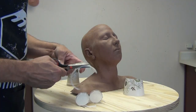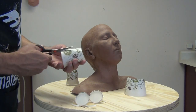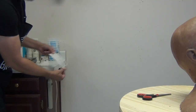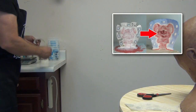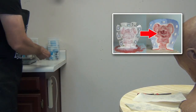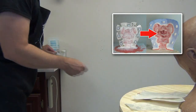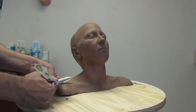In order to isolate the head in the part of the mold I want to make, I'm going to cut up some paper cups and create a little shim dividing wall to isolate the head from the shoulder area. I'm doing this instead of brass stock or metal shims because it's much easier to clean up. I've cut out wax paper cups and I'm using the countertop to straighten them out. For those unfamiliar with this method, definitely check out my full-length video on the shim technique for multi-piece molds.